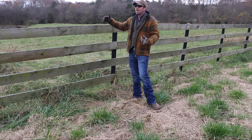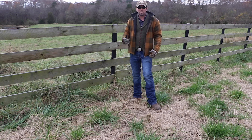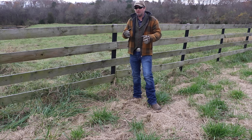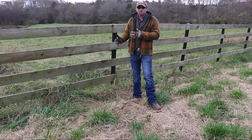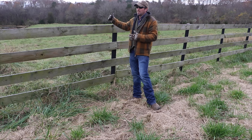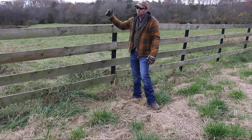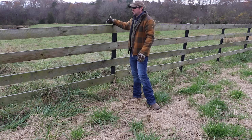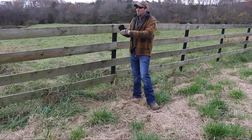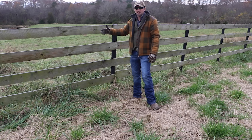We built that entire section of fence all at once to make it stay together solid. It's a completed product, and things aren't going to start falling off because we didn't complete it. You can't get ahead of yourself on a fencing project. It's better to build a completed fence in sections than to try and run all your posts, go back, run all your wire, go back, run all your boards, go back, run all your 1x4s, go back, cut the tops off — doing all of that at different times. It's better to do all of that at once and do less fencing than to stretch yourself thin, not be able to get the materials, not complete the job, and then try to go back to it six months to a year later. That just doesn't work.